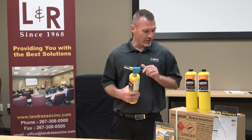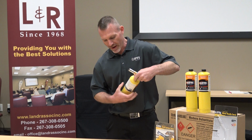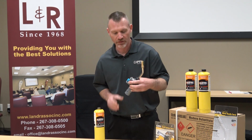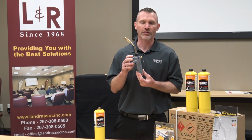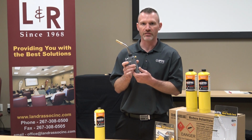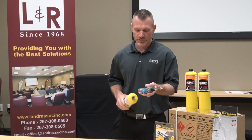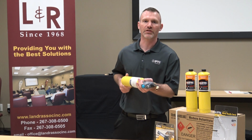So that's our HB875B. Next up, we have our Bluefire HTS 8088. This guy right here will be comparable to your Goss or Turbo Torch self-igniting torch tips. Oftentimes remodelers, small-time guys, even guys that are doing big jobs have these in their toolbox because it's a lot easier to pull this thing out with a canister than it is to break out an MC tank or a B tank if you just have a small repair, small job that you're working on.